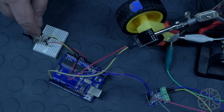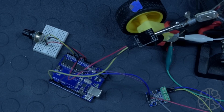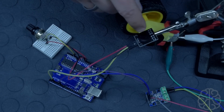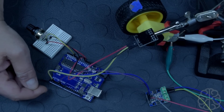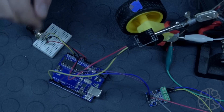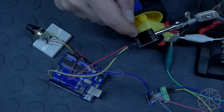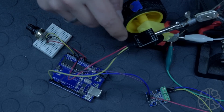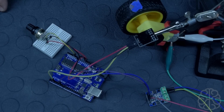The connections are not very complicated. The potentiometer is connected to pin A1, and we'll map that value to set the motor speed using the L9110. The speed sensor only needs one pin, connected to pin 2 on the UNO. Pin 2 is linked to interrupt 0, and we use an interrupt to increase a counter every time the sensor beam is blocked or opened. We'll also use a second interrupt via the Timer1 library — a one-second timer — and when it elapses it will display the counter value on the serial monitor.